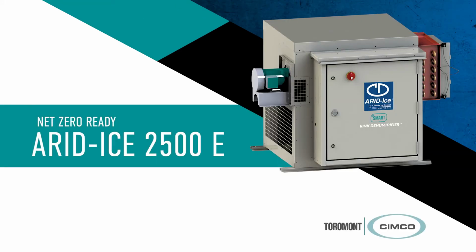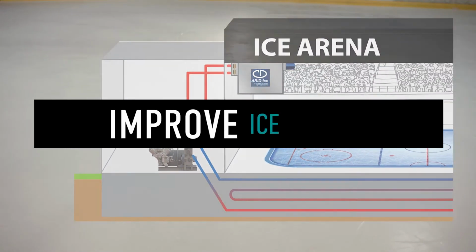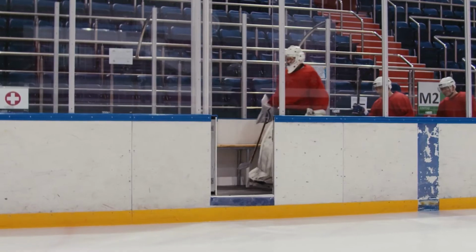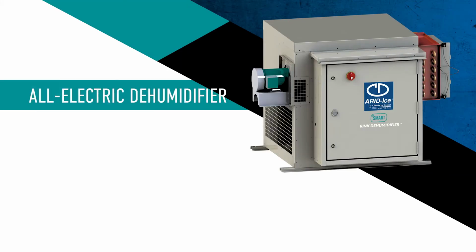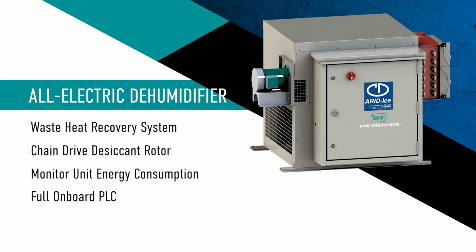Introducing the Net Zero Ready ARID ICE 2500E by Climate by Design International, a compact desiccant dehumidifier designed to improve the quality of your ice by removing moisture efficiently, reliably, and safely, and eliminating fog, dripping, and mold. Suitable for seasonal ice rinks, this all-electric dehumidifier includes a waste heat recovery system, a chain drive desiccant rotor, monitoring of unit energy consumption, and full onboard PLC.